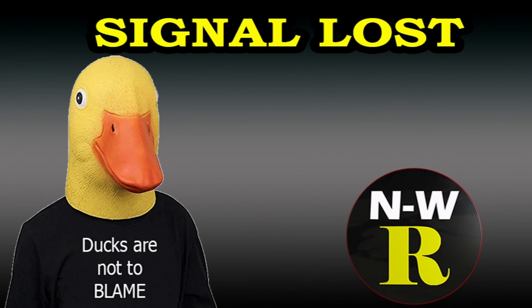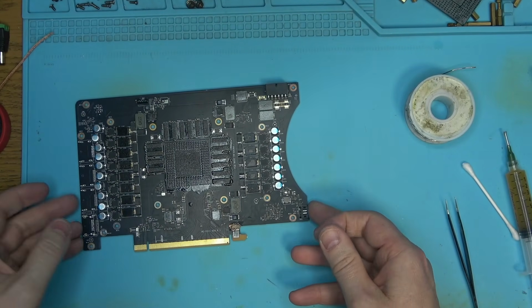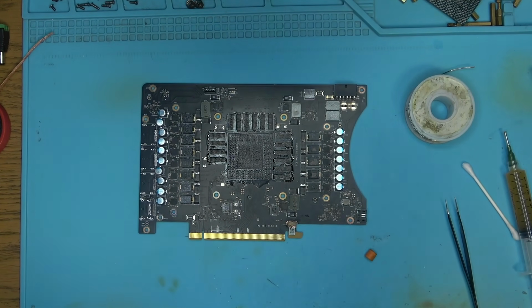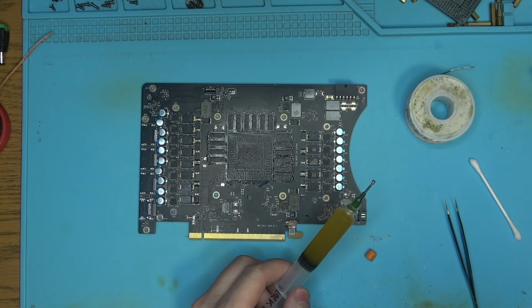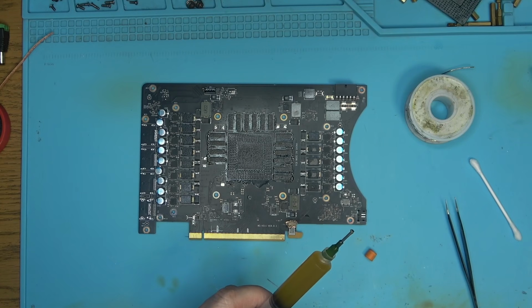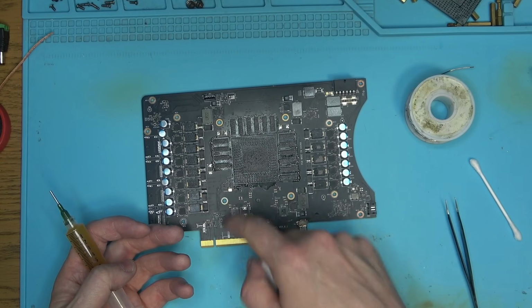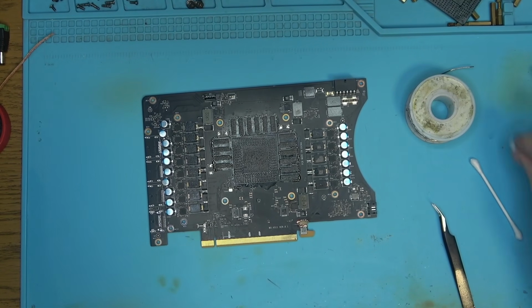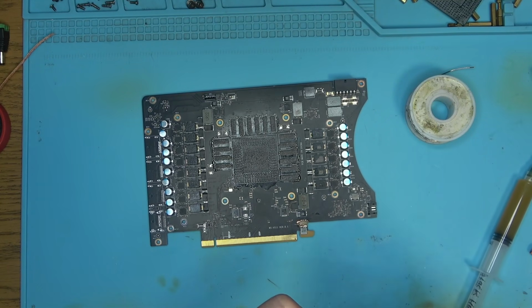So my guess, based on what I've seen so far with this flux, is that it is not for micro soldering. I mean, it could be used for micro soldering, as you've seen here, and it seems like it's doing a half decent job, though it does tend to solidify a little bit sooner than I would want it to. It is an absolute disaster for reball, but it seems like it's good for general soldering because of how oily it was during the cleaning of the pads on the board, how it lubricated the board, minimizing any kind of scratching damage to the board. That was beautiful. It was so smooth. I was actually amazed.